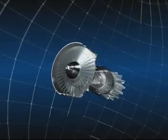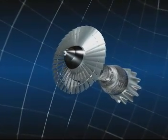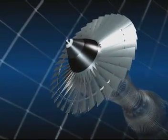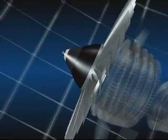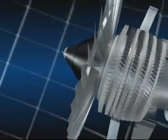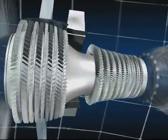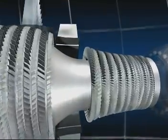These are the various components of the CFM 56: the fan, which is a large diameter propeller, and the low and high pressure compressors with 13 stages, which step by step increase the pressure of the air as it flows through them.